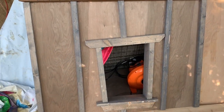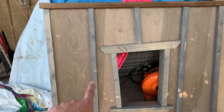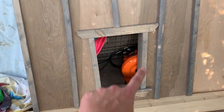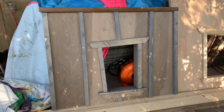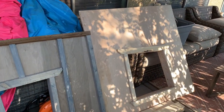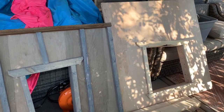This is a finished section where I did the vinegar on the plywood, and I used the weathered gray stain on these strips and around the trim. I'm pretty happy with the way that turned out for my old rustic look, and there's a flat that I still need to do so you can see the contrast between the two finishing techniques.